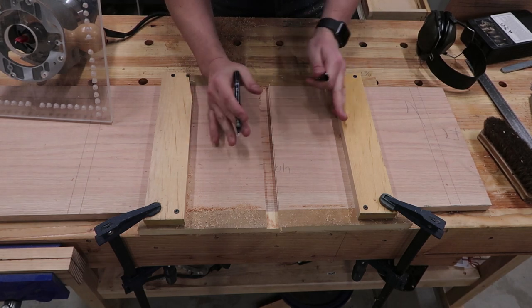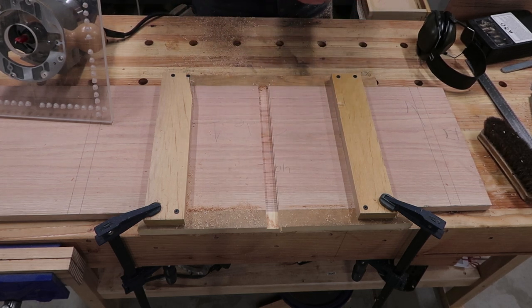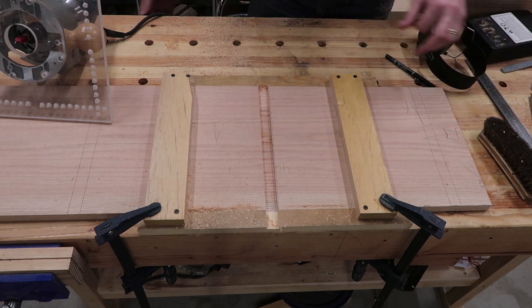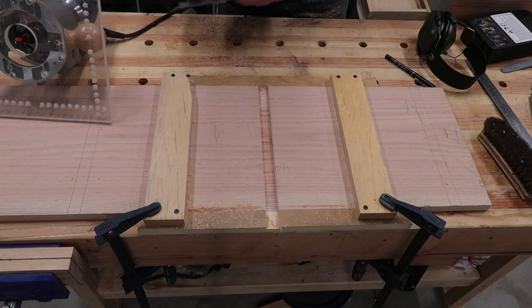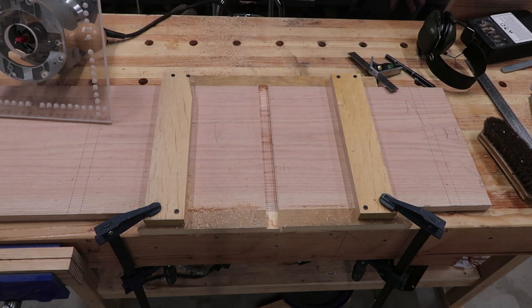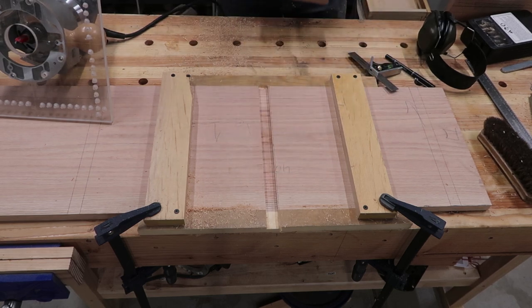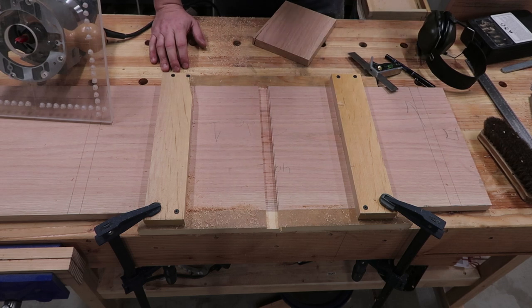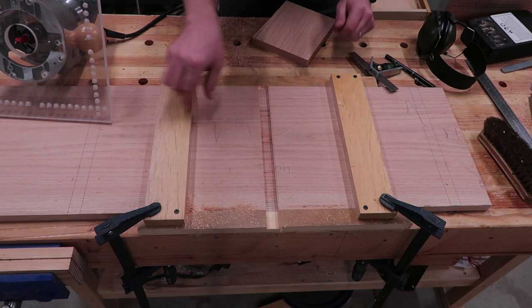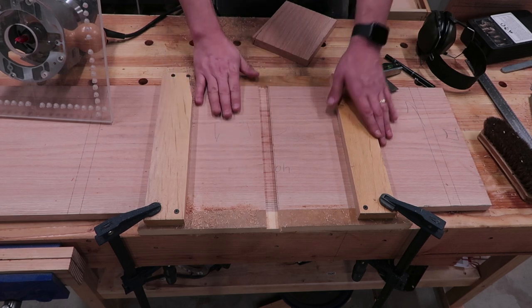The jig was off a little bit — I got about a sixteenth of an inch extra on one side, and that side was also a sixteenth over. Measuring it, it's about a 32nd of an inch too big. I grabbed a piece of shelf and it's a little loose. For the remaining ones I'm going to bring it in a little bit. Looking at the line, I can see the board shifted over slightly, which is why it cut on that side of the line. I'll tune this in to avoid wasting any more wood.